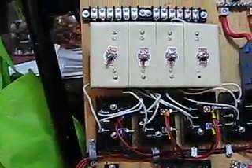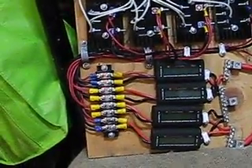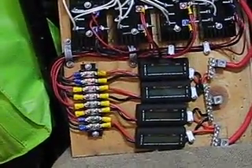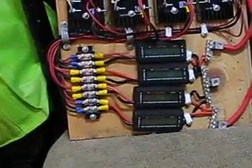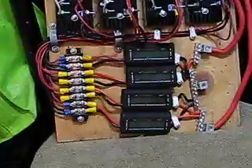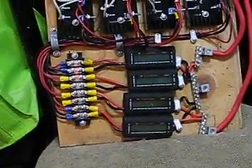I can use the switches to isolate and see if one PMG is producing more than the other. I figured I could put a 1500-watt load on each circuit, and then for my smaller PMGs I have an 800 and a 300.